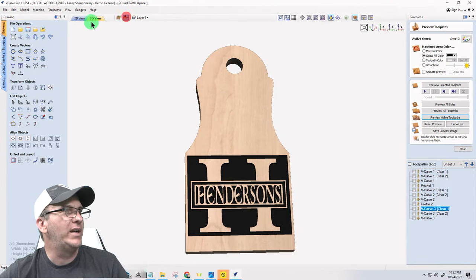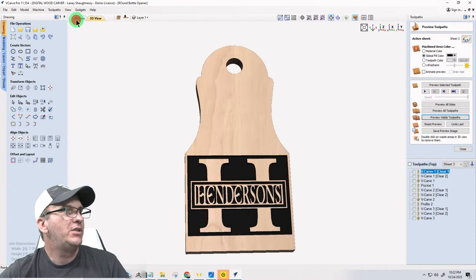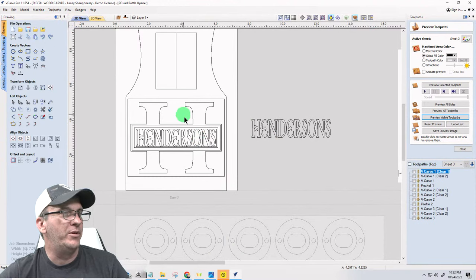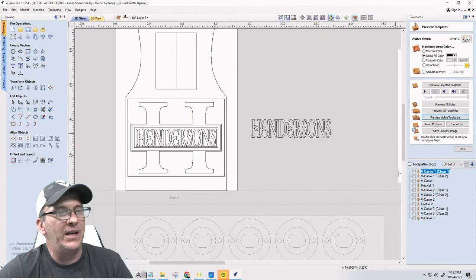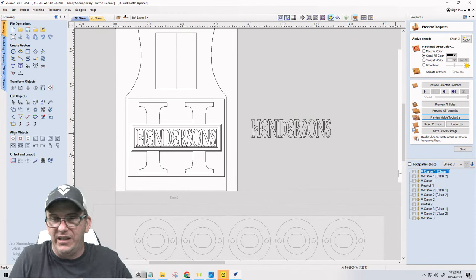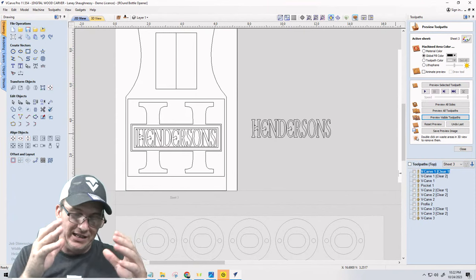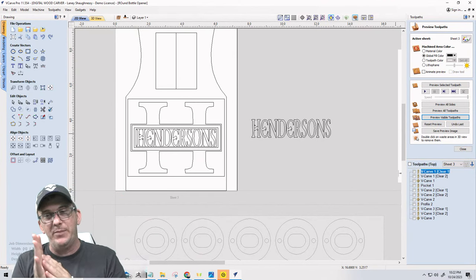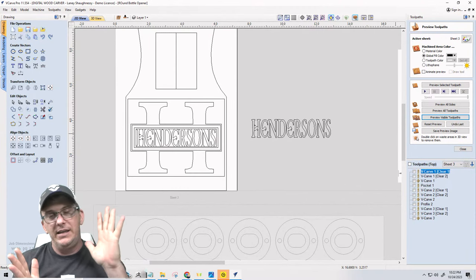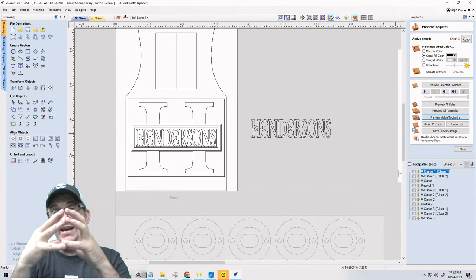Now, side two, very quickly. On the back side here, I want to have a magnet catching. You know, here's where that bottle opener is going to go. So somewhere in here, I want to have a magnet. Now, those magnets are 3 millimeters thick, and I can go with a thicker magnet, right? But I don't. I need it to pull through the wood. So I'm going to be putting a pocket on the back side, and the pocket's got to be deep enough that a magnet can get epoxied in. But there's still a thin skin of wood that the magnet can still pull through.